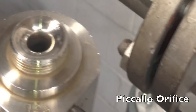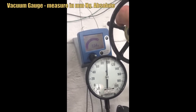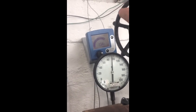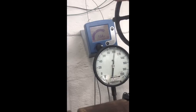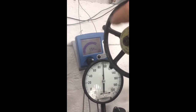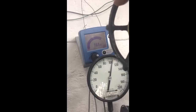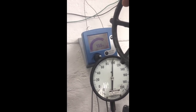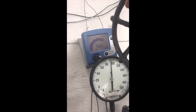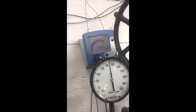This is a close-up of an orifice. Here we are going to show how we use a motive steam pressure gauge and a vacuum gauge which measures in millimeters of mercury absolute. We will show the effects of increasing the motive steam pressure above the design steam pressure. This ejector was designed to operate at 85 PSIG motive steam. As we increase the steam pressure above 85 PSIG, the absolute pressure of the ejector rises, which means the vacuum is getting worse. We went up to over 100 PSIG and the vacuum went up to 160 torr. As we lower that steam pressure back down near the design pressure, you can see the vacuum improving and the absolute pressure decreasing.